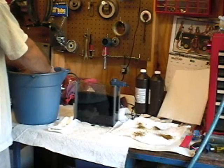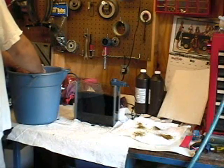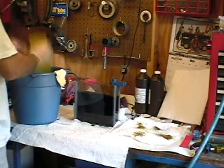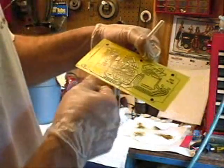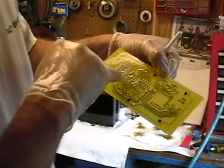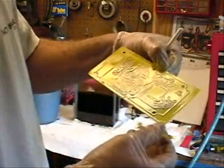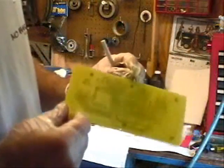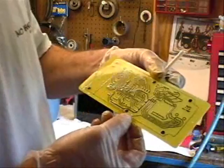We'll put it down in the water — this will neutralize the acid for right now. Wash it off gently. Now we'll do a visual check. Make sure all of the holes have been etched out on the insides, all the traces. Check in between those — make sure there's no copper left. Also want to check the back; you don't want any components shorting out on the top of the board. This one looks finished, so we'll go with it.